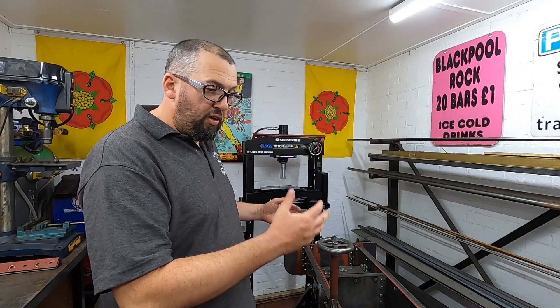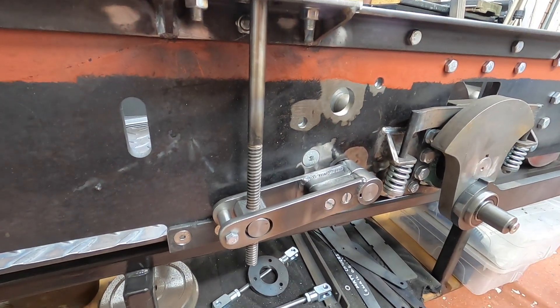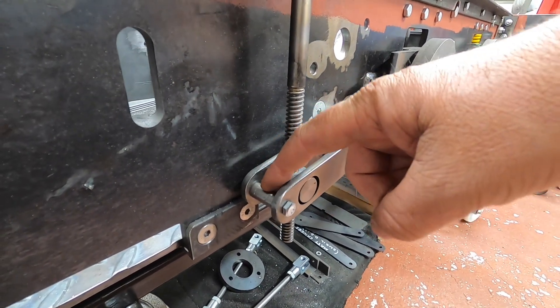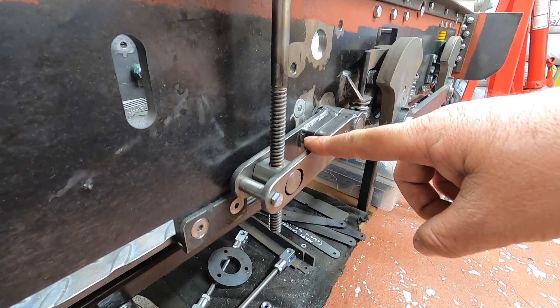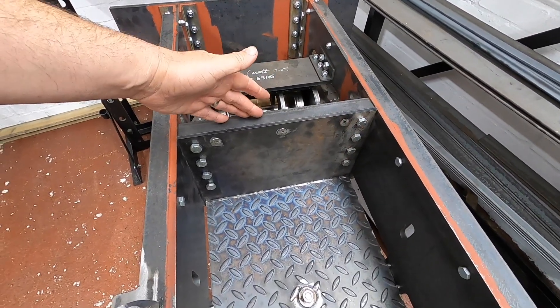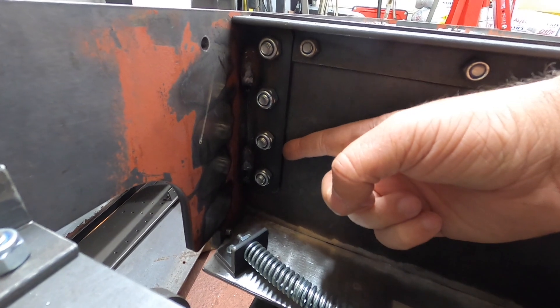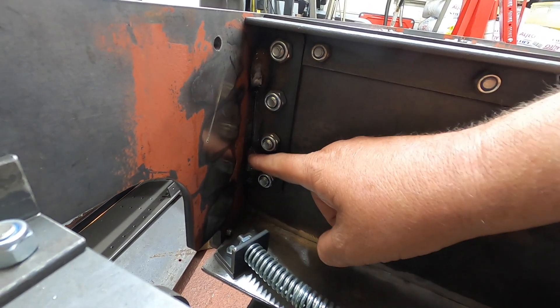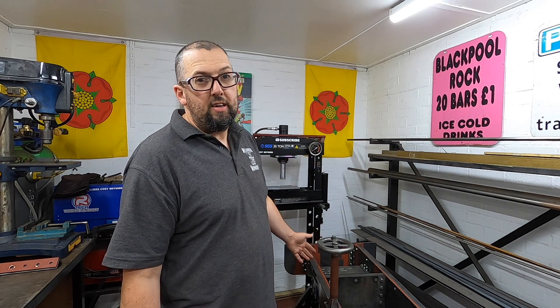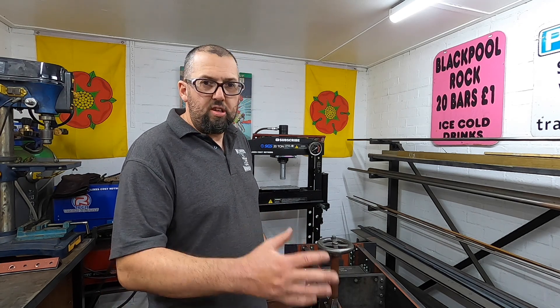Everything's great there. We've also got the lovely brake handle in place, which goes down to our pull shaft link. I've put a piece in at the end to stop it spreading when it pulls up — I noticed it trying to open just a little bit, so that will stop it from moving. I've also put the rear kick plate back in. I simplified how I've done that — no angle iron in the end, not bolted from the outside. I've used two pieces of flat bar welded to the frames. Behind there we're going to keep all the air brakes.